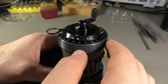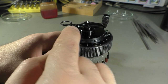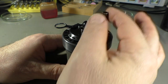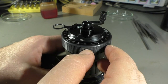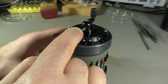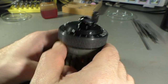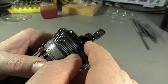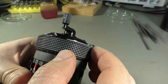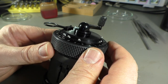So I thought I don't drill a hole at all, but I cut the thread into the crank here, and then I take a screw, and that works too. I will, of course, replace that screw with a shorter one, with one that goes inside here, so you won't see that screw anymore when it's finished. And probably I will also put the second screw into the hole here, so I can clamp the shaft from both sides. That's not a big deal.